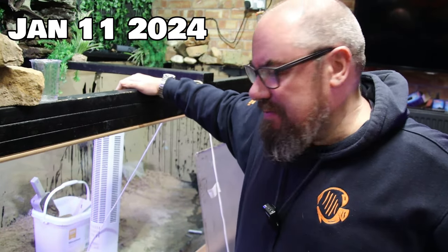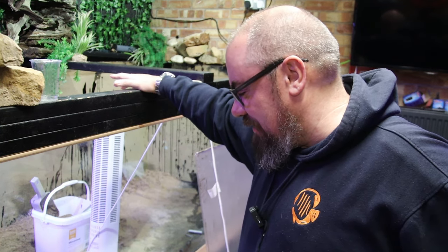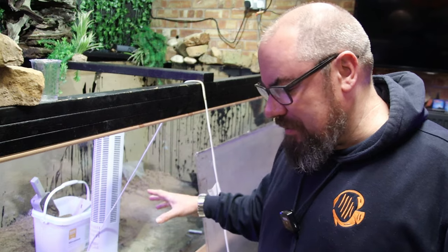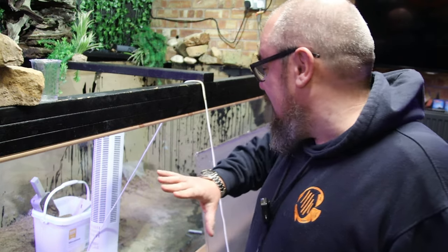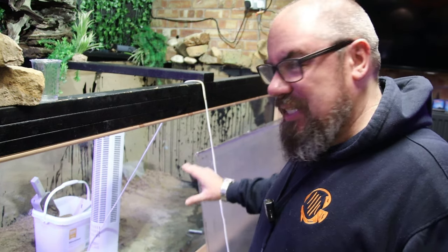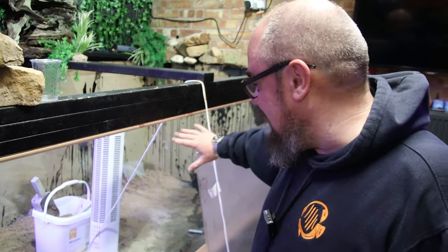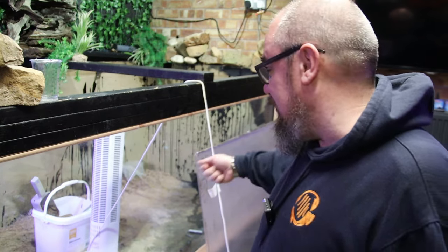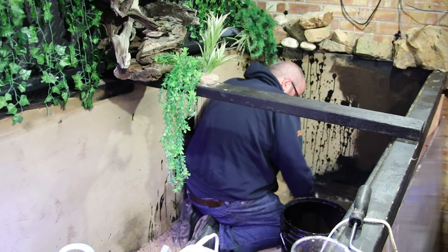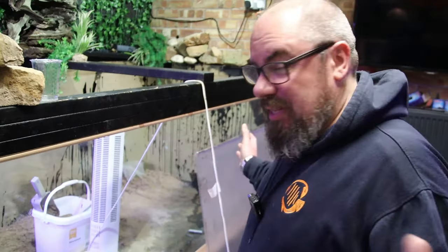Day 775. I've changed the plans again - I used to be indecisive, but now I'm just not sure. I haven't taken the sand out because I found it was a little bit easier just to get in there and sieve it in situ. So I've now got a bucket full of nasty sand that was contaminated with all the liquid rubber, and the rest of it's all good I think. I have glassed the offending corner where they were having the trouble. So I think we're good to go now - just aesthetics. I'm going to get in and try and peel off as much of the splatter effect as I can, and paint over - or rubber over - as much as is left. I've done a full inspection and everything looks good. I'm hopeful.